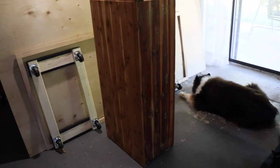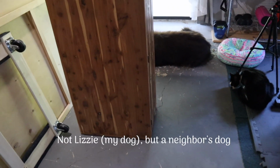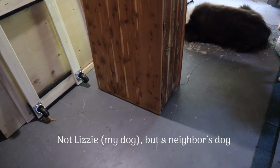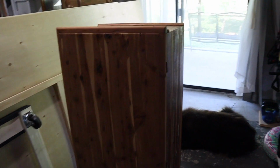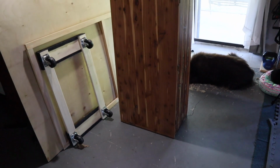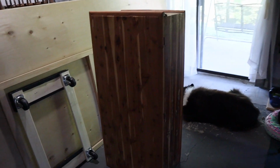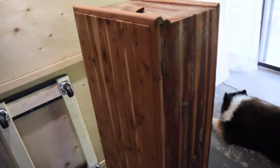I'm not sure if it worked. I was so exhausted after sanding it and being very upset that the dog peed on it after I sanded it. I cleaned it twice, so I cleaned it off, but it stained it, so I'm not sure what to do right here in this little spot. I've cleaned it with Dawn dish soap, I've cleaned it with ammonia, it being raw wood, it just soaked in. So what I think I might do is just try to top coat it and deal with it. See if it really pops up. And if it pops up, then our 2-hour sanding session is for naught, and we will have to paint the whole thing, which makes me sad. But that is what we're going to do today.